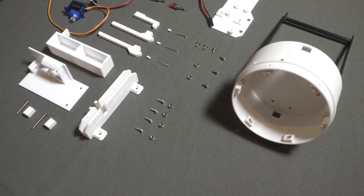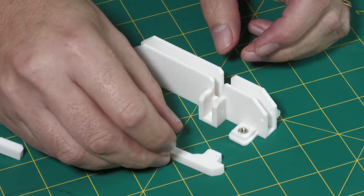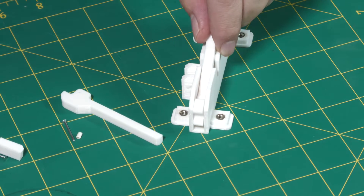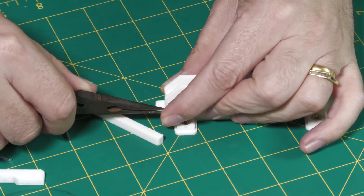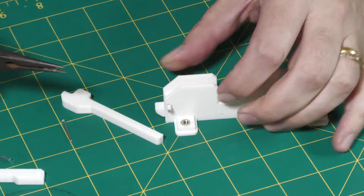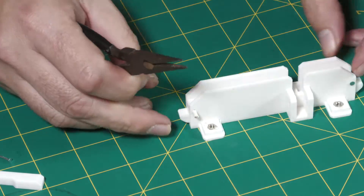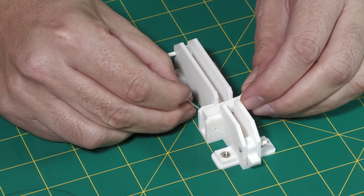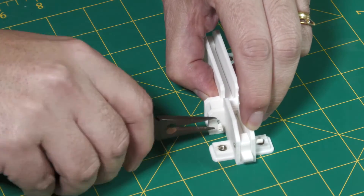To hold that much force back, we've made the levers a little thicker. But with a lever ratio of about 10 to 1, that was going to put a lot of force directly onto the servo horn. So we added a third 4-to-1 lever to reduce that down to about 2.5 newtons of force on the servo motor. This needed us to reprint the lever bracket, and the levers are held in with pins made from small nails.